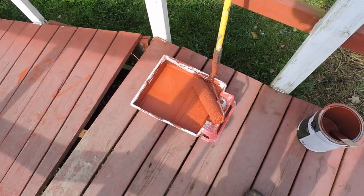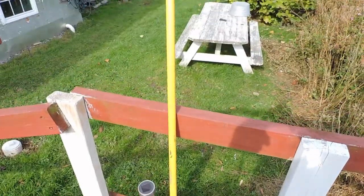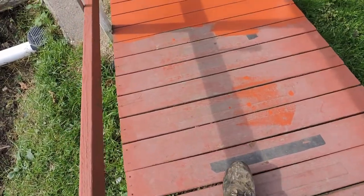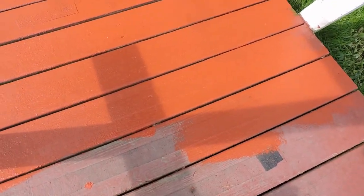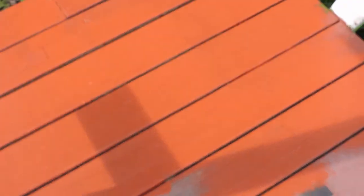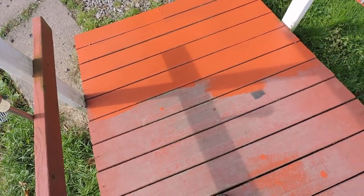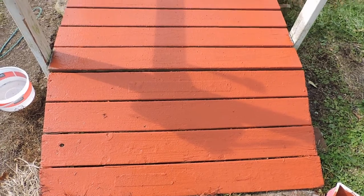The paint is mixed with the sand, poured into the paint tray, and I've started painting. It's just a basic roller with an extension so I don't need to work on my hands and knees. If you look close you can see the sand grit in there — that should be just enough to give people extra traction. If I find out it isn't enough I'll hope for another warm day and do a second coat.